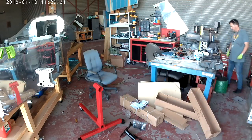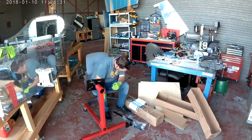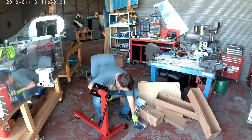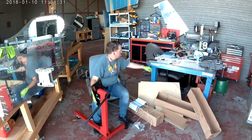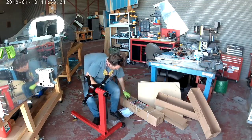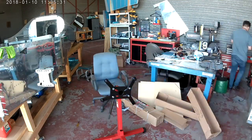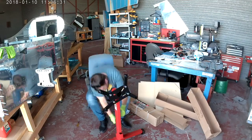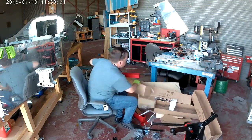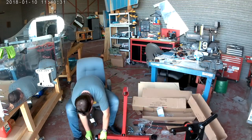Now what does that mean exactly? You can see me putting together a little engine mount that I got from Harbor Freight - it holds 750 pounds. I mean, that'll hold this plane's engine. The idea is that that flat plate rotates 360 degrees. You mount that to the front of your plane, you mount another one to the tail cone, and now all of a sudden you've got a fuselage that rotates all the way around. So you want to work on some fuel system stuff? You don't have to crawl in - you can just rotate the fuselage 90 degrees sideways and just start working on stuff directly in front of you. It's going to be sweet.